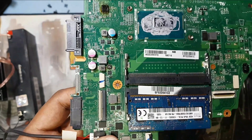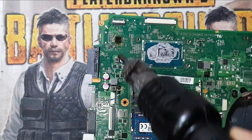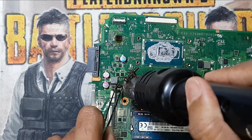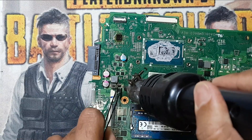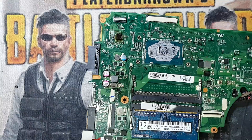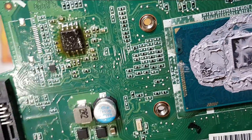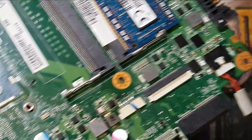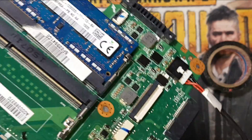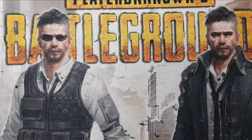Connect one here to the soldering pad and replace another one - it will work. In one second you can find out where is the short. So this one is short. I will remove it now with the hot air gun. I use the hot air gun and remove this. See, this one was the short - I removed it. You can find this component on any board.